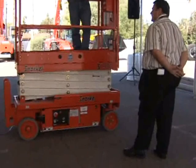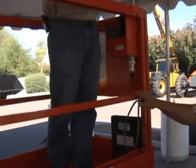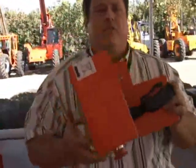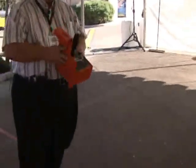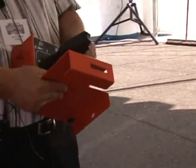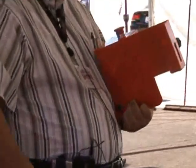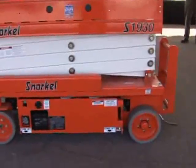I'm going to start at the upper control box at the top of the unit. We use square tubing like a lot of people here. The upper control box is a metal-encased enclosure. It is also quick release and detachable. For mechanic-friendliness and operator ease, I have basically three components in my upper control box: a joystick with a 10K potentiometer and two micro switches, an emergency on-off button, and a toggle switch for steer. The decaling and placard system is very easily read. The Snorkel product is not cluttered up with a lot of different placards—it has the requirements, and it's very easy for an operator to understand what it can and cannot do and what the limitations are.